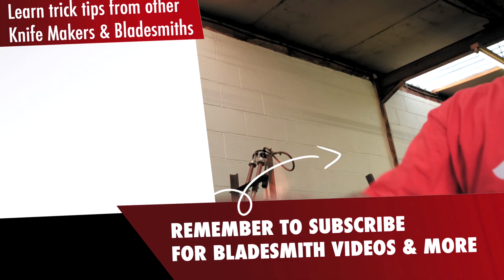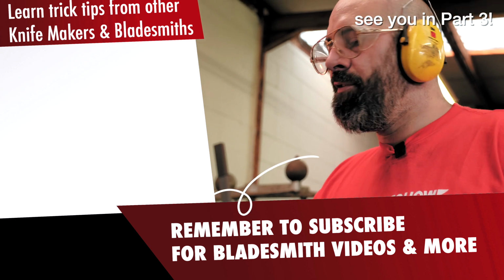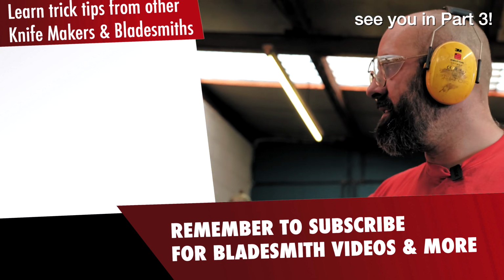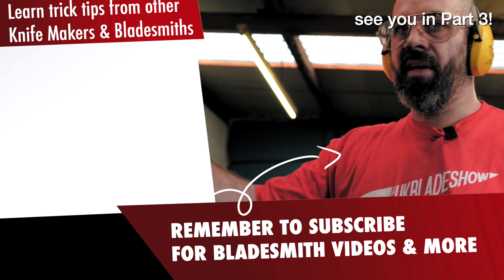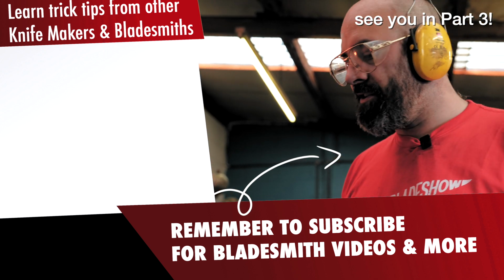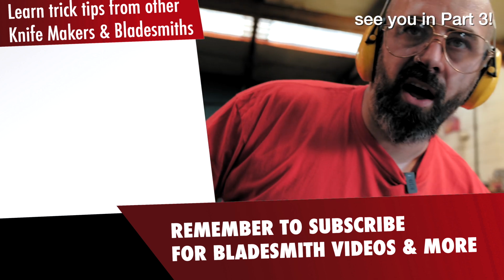It looks very similar to the other lump of steel from a minute ago, but the inside is different. Yeah, if you've welded it well, there shouldn't be any splits. This bar will end up with a split at the ends, both ends, like I say. We'll just trim that off a little bit using the tool and then clean it up and restack it. And then that's stage one done, almost.